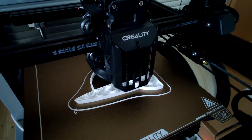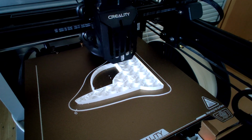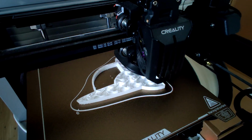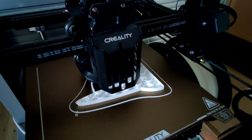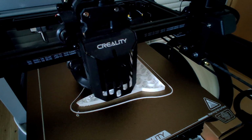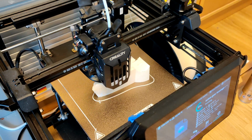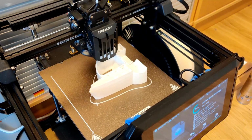Overall, I am fairly confident that by the next spring, this plane will be ready for a test flight. I am not entirely sure if it will fly or if it will even survive the test flight. I am planning to do a couple takeoff runs where I just pull up very slightly and then let the plane settle back down on the ground to figure out where the center of gravity needs to be on this thing and what amount of up elevator is enough to get the plane climbing, since the elevons on this plane are really massive. So turning them by just a few degrees should already give a pretty significant result. I will also have to do some testing how sturdy the landing gear is that I'm designing by myself, and generally how sturdy the entire structure of the plane is.